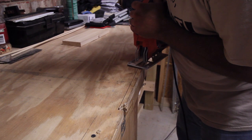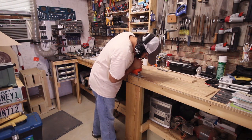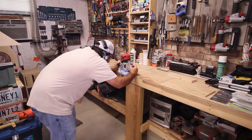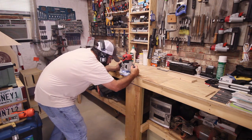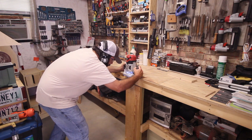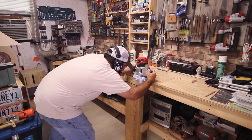The start and stop faces of this particular cutout were established with a handsaw, and then the rest of the material on the inside was rough cut with a jigsaw. We wanted to use a flush trim router bit to clean up the back face, but it didn't really work out as planned. The flush trim router bit was pretty small in diameter, and the bearing ended up gouging into the 2x frame material below the plywood top, causing an uneven cut surface. Better results probably could have been had with a larger diameter flush trim router bit.